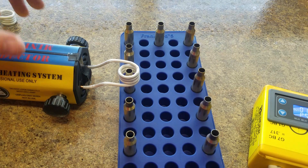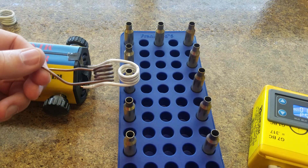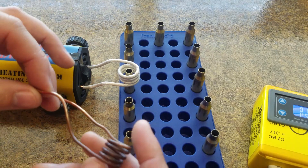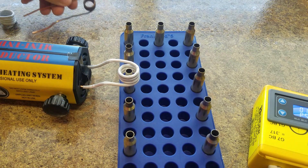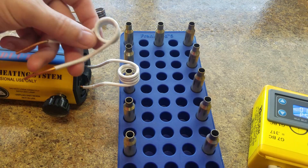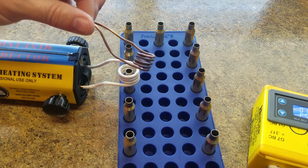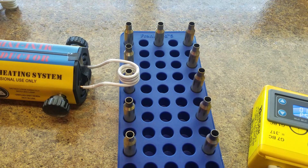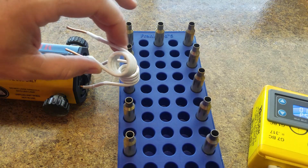You can actually make your own coils. The sheathing on the coil is only there so the coils don't touch each other. If you go to Home Depot and get your own wire — the thickest gauge they have that'll fit — you can basically make your own coil, as long as the coils don't touch anywhere. These coils can be really expensive when buying them online, but this kit comes with plenty to make probably at least a dozen or more, which will last you a long time. Even if it doesn't, you can still get by with a standard coil. The tighter the coil fits around the cartridge, the faster it heats up.